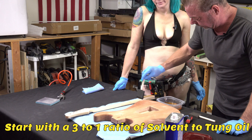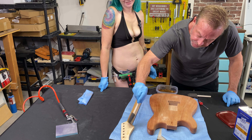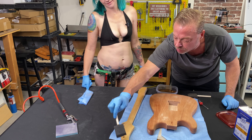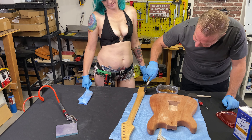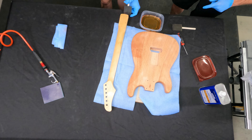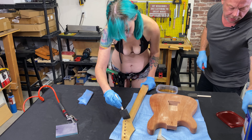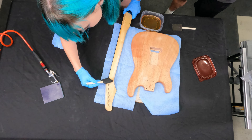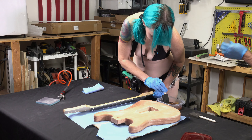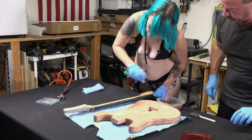This is a thinned-out mixture. There's no one way of applying this - you could use a rag, you could use a brush. I call it like licking it on. Lick on the tung oil, use it liberally. These first few coats are going to go fast. If you see a puddle, wipe it back or find a dry spot and work the puddle area toward it. Get the sides too. Don't worry about getting the fretboard with the top of this application.